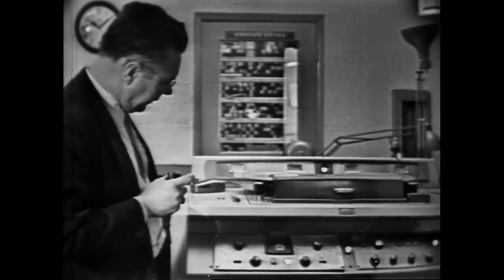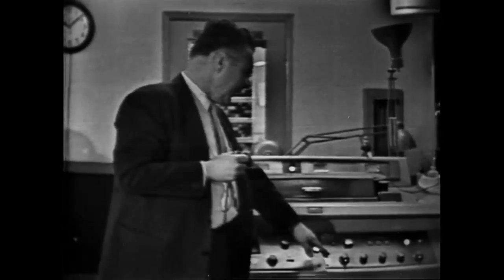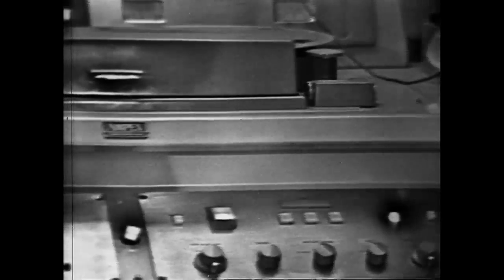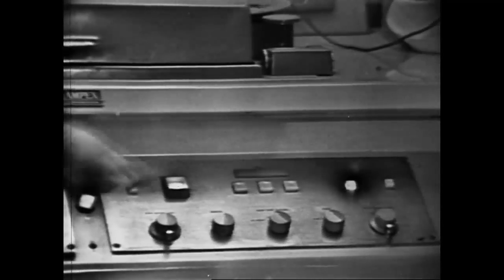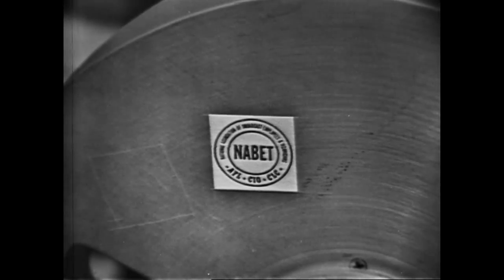I think we've covered just about all that you could possibly see on the machine now with the camera. The right-hand control panel is essentially the same as the left, except that it controls all the audio gear — the audio record amplifiers, the bias amplifiers, playback amplifiers, and so forth. All your stop and start functions are on this right-hand control panel. The light right here is the record indicator, which shows that we are recording on this machine. This concludes the portion from the Videotape Room — I'd be very happy to answer any questions you might have. This has been an ABC videotape edited production; audio and video effects were not mechanically reproduced.